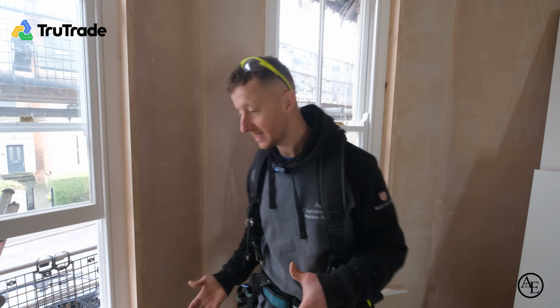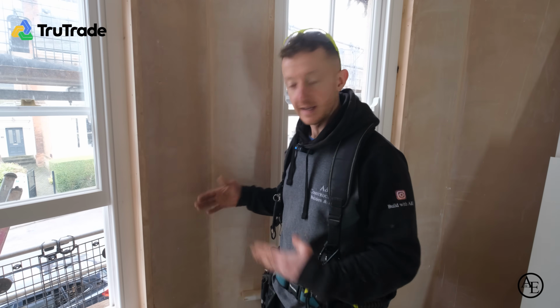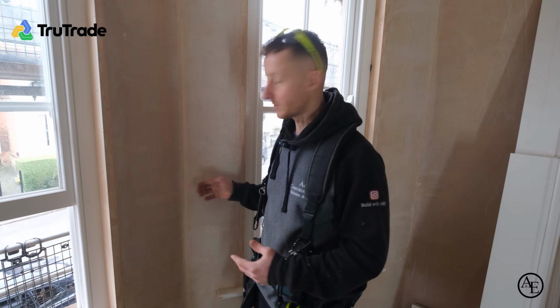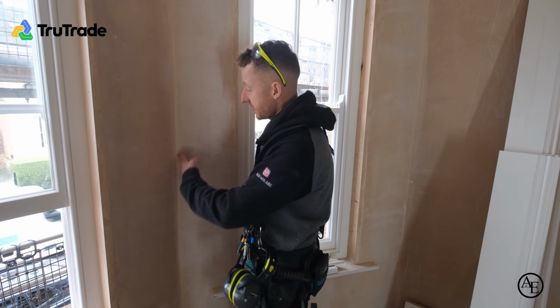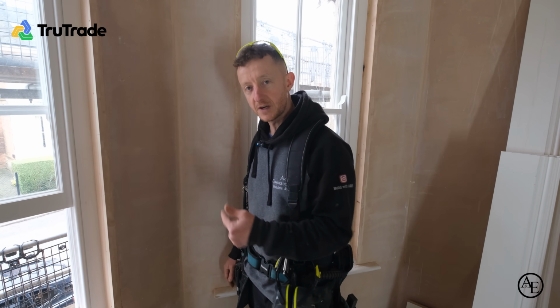Right, so the first thing that you're going to come across is obviously the issue of finding an angle. If it was a normal 90-degree corner, then that's a fairly straightforward thing. Whereas something like this, you need to work out this angle and then you need to bisect the angle to make sure that your two pieces of skirting where they intersect join nicely and you have a nice line which comes through the middle. So first of all, let's figure out how we do that.